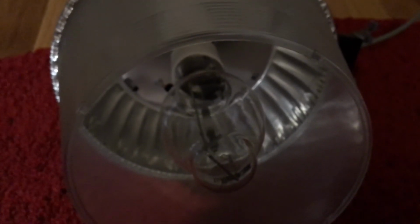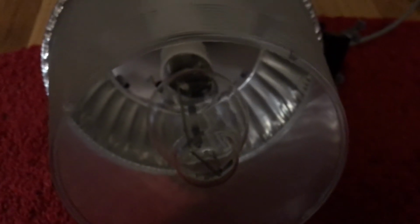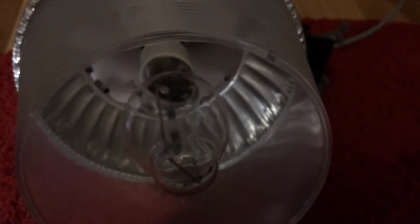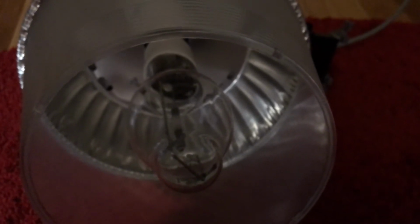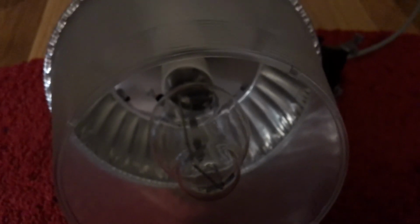So this particular yard light here produces around 6300 lumens, because it's high pressure sodium and it's 70 watts. Ballast type is S62 and it is rated 1.6 amps, and lifetime on the bulb is 24,000 hours. So that's quite nice. Anywho, I believe that's that. I don't think I have any more specifications to say out loud. I'll put the rest in the description below.